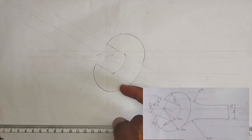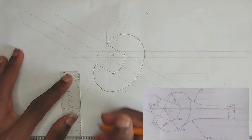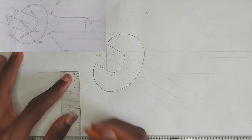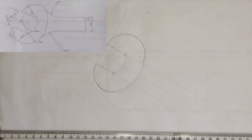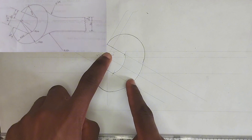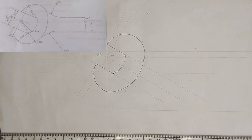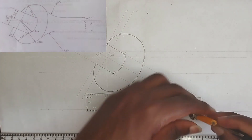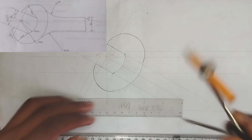To draw this arc, the radius is 52 millimeters and the radius of the larger circle is 48 millimeters. So we first pick 52 millimeters on our compass from this edge, then draw a straight line from point to point. From this particular place, 48 plus 52 is 100, so I'm going to pick the radius of 100 millimeters on my compass.